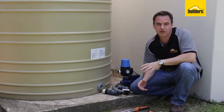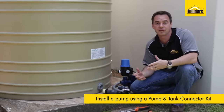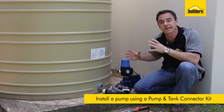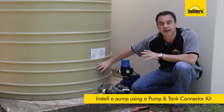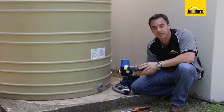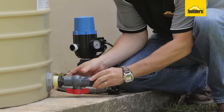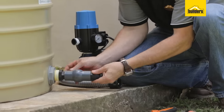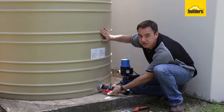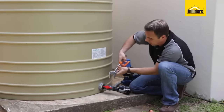This is the last part of the installation and the most important part for me — applying a pump which can give you pressure for your garden hose. This pump comes with a kit that's got everything you need in one box to connect to your tank. We start off with the connector with the ball valve and quick coupler, which is going to connect to the bottom of the tank. Every JoJo tank comes with the same size fitting, so it doesn't matter what size tank you use. I'm going to give it a final tighten with some water pump pliers.